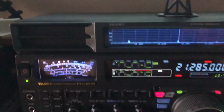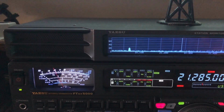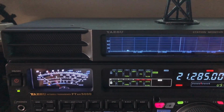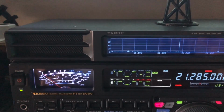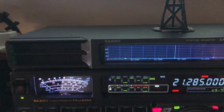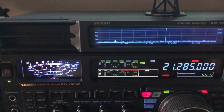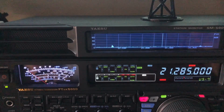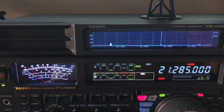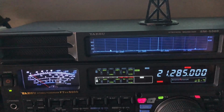Well, now look at that. Ooh, look at that signal. Doublet. Uh-oh. ZS6BKW giving the doublet a run for the money. That's 250 feet of ladder-fed antenna versus 97 feet and a few inches of ladder-fed antenna in combination with 75 feet of coaxial cable. So, I now have a new 15-meter antenna, yo. Oh, man. Hey, the 15 meters hasn't been open enough for me to really give the ZS6BKW an opportunity. So there we go again.